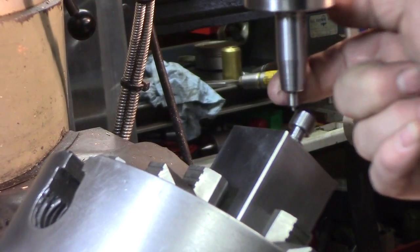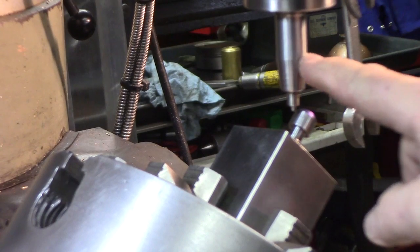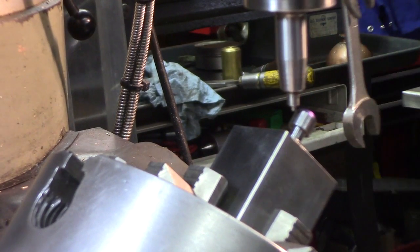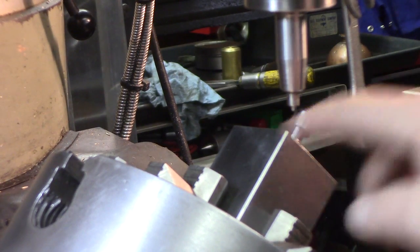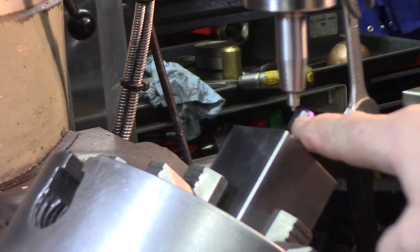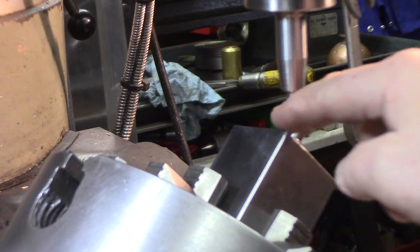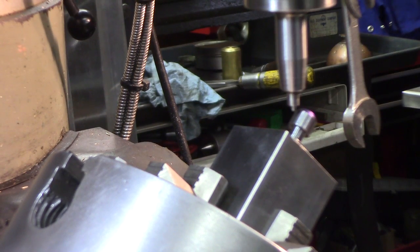We're using my diamond engraving tool, which is spring-loaded on the end, from my X-Carve. I just have it mounted in a collet and we have the quill locked in place. Even if it turns it wouldn't matter, but it won't turn. We're just going to scratch across there. I brought it up approximately ten thousandths as far as the compression goes and it should slip right across.